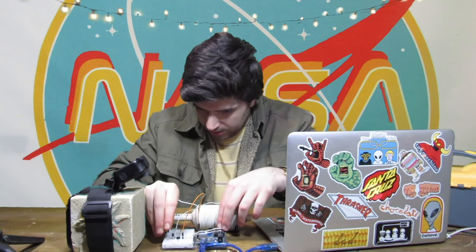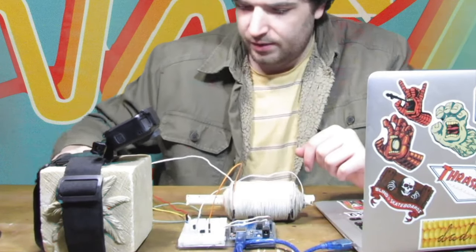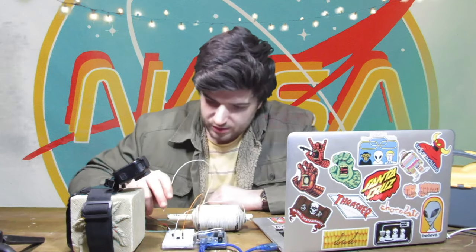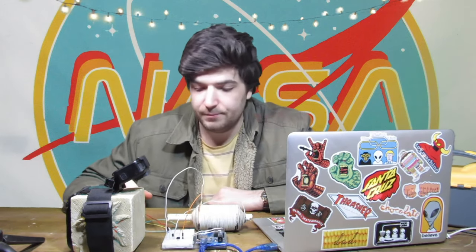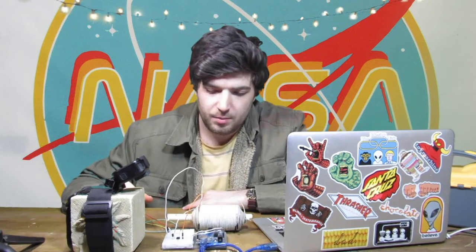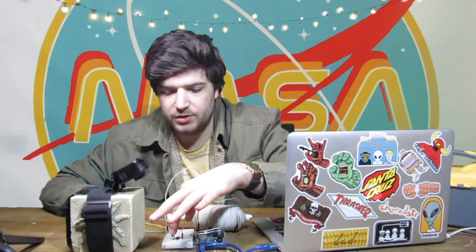So now we replace the collector pin with a resistor. I'm going to assume it's going to take longer for this thing to smoke, or the resistor is going to get really hot — I really wish I had a thermal camera but I do not. Maybe one day. No smoke — it's just getting a little hot. So for higher power applications BJTs just don't really do the job. They're good for things like LEDs but not great for high current applications.